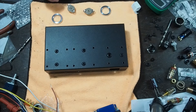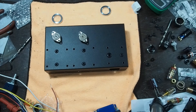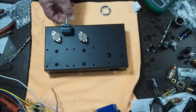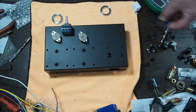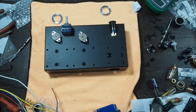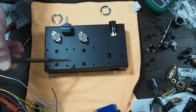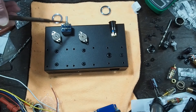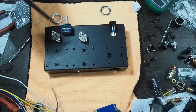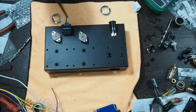I initially was planning on putting the tubes in front of the output transformers, putting the volume control in the middle, and putting the power switch over here somewhere. But when I started looking at this layout, the problem is — even if we put the RCA jacks here or even in the back — you're going to be running them right up near this potentiometer, and then the heater windings are going to have to go right by this potentiometer.